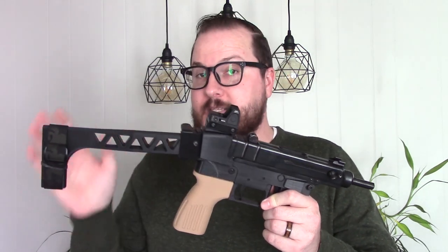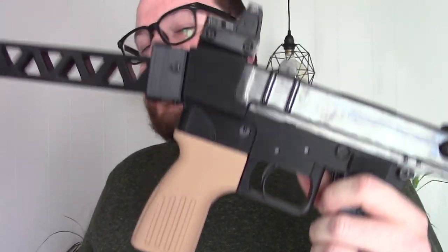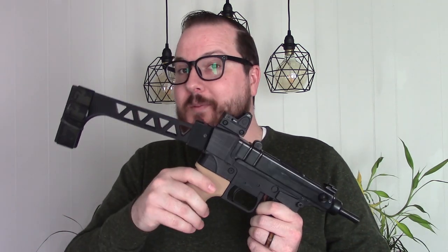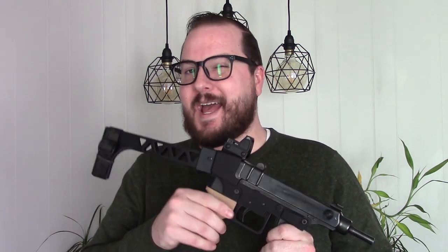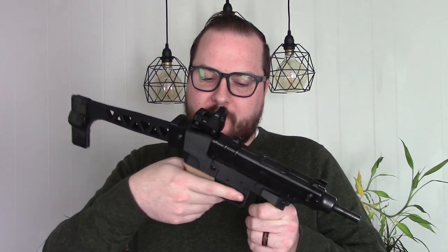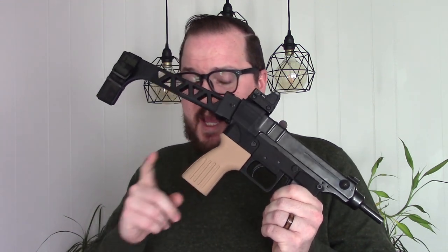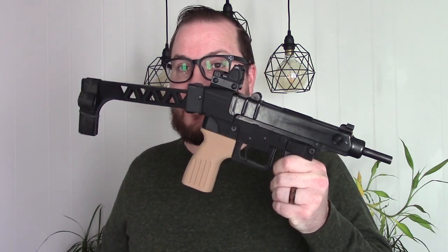The receiver itself is made out of PLA Plus. The grip on this is kind of interesting — it's made out of 3D printed wood. There are filaments out there that use wood powder: about 20% wood powder and 80% PLA, and it is printable wood. You can sand it and stain it just like real wood, and it has a cool texture to it. This grip is included in the files you can find for the CZAR. It's an AR-style grip shaped like a VZ61, with the correct vertical angle, and the thing just looks really, really good.